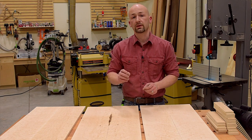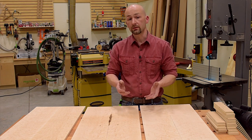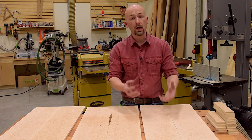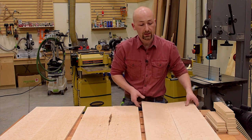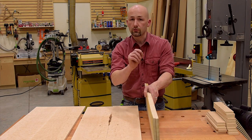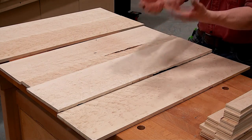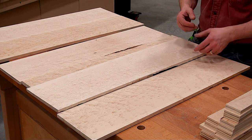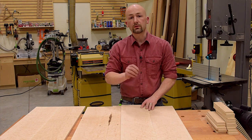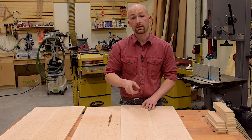There's something really important to consider: I'm not at my final thickness yet. These need to be glued together and milled, but if I were to do that right now, they would cup a great deal. The reason is that when it was kiln dried it was an inch thick and there was still some moisture trapped in the center. Once we rip it down the center, we're exposing that moisture and it can evacuate. To prevent cupping, before we mill to our final thickness, we're going to need to sticker stack it.